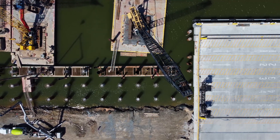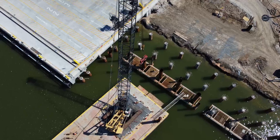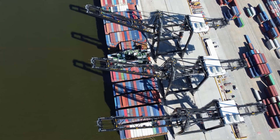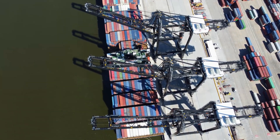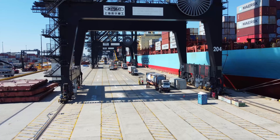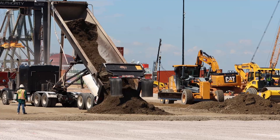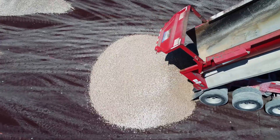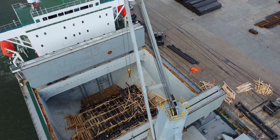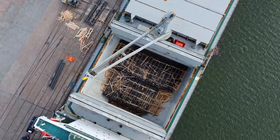The structural deck is the one that supports all the load and transfers it to the piles. The surface of the wharf is used in a very abusive way and frequently needs to be repaired or replaced. It is very easy to repair damaged pavement, but it is very difficult and time-consuming to repair structural components. This is why there are two separate decks placed independently of each other. The loose material between the decks protects the structural deck from damage that may occur on the surface, especially from significant dynamic impacts – for example, a heavy steel coil falling from a crane or truck. The surface deck is also called the sacrificial deck.